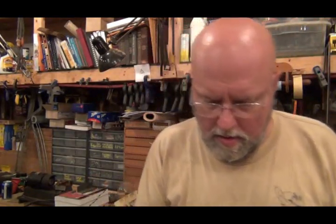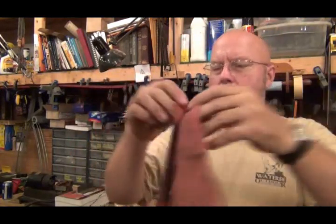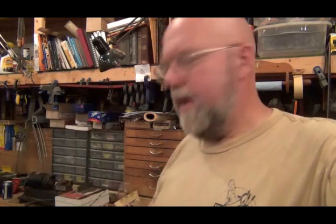One other thing — there is something about linseed oil: if you just take this rag and wad it up and throw it in a rag box, the linseed oil and the air will get hot and spontaneously combust. So what I'm going to do is take this out and lay it flat on the stones in the sun so the sun can dry it out rather than keeping it moist in the shop. So remember that about boiled linseed oil — you don't want to wad up your rags and just throw them in a box.